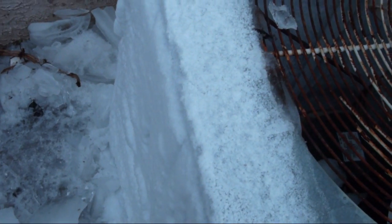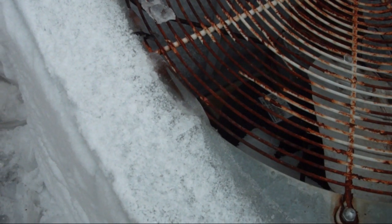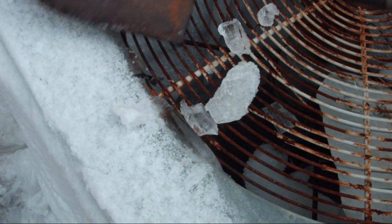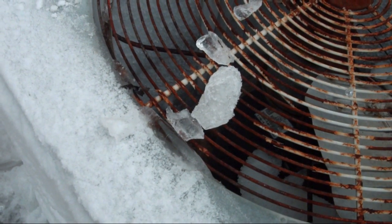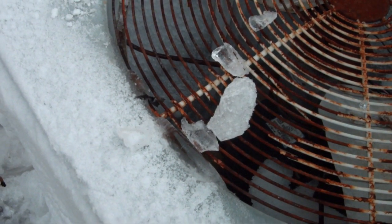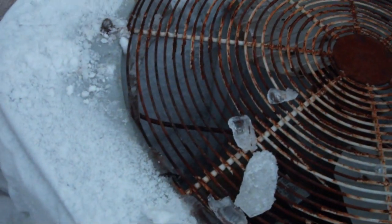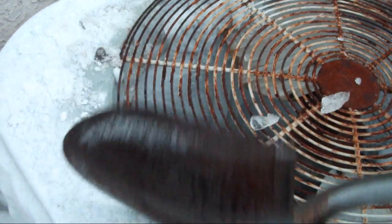So how many times has this happened? Never. I think it needs a new defrost control board. There's a little microchip that goes in there, and basically it switches into air conditioning mode, and that melts all the ice off of it. It uses the auxiliary heat to heat the building while it's defrosting. And that's why the auxiliary heat comes on — or if the heat pump just can't work very well in the winter. If it's too cold for the heat pump to work, then it'll operate on just the auxiliary heat.